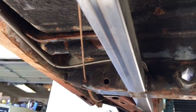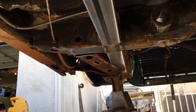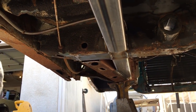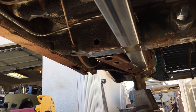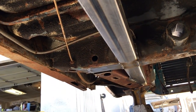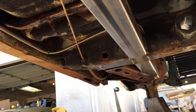And you can see how much better this style subframe connector is. Look, it goes through the torsion support and then ends right at the front frame rail. So, way more is better. This way it triangulates everything. That's boxed right there. So not only that, it's stiff.